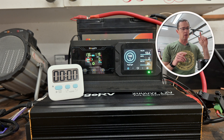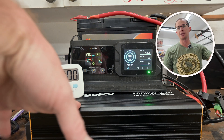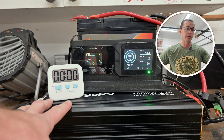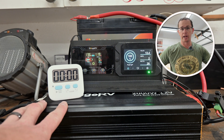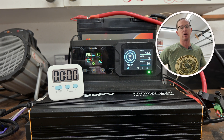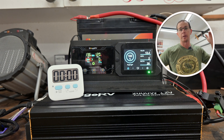It is time for our battery test with the Tech Sella battery. For our test setup, we have a Bouge RV 2000 watt pure sine wave inverter. The battery is rated at 1280 watts, and this is a 2000 watt inverter, so we're able to pull more than the battery's rated capacity. We're going to test the over-current protection — the capacity test already came in at 108 amp hours, right up there with the high scores.